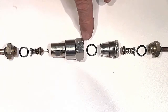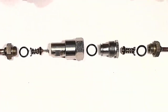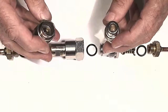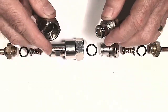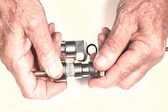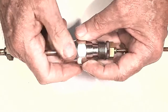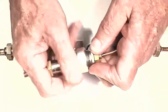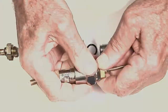In the middle we have the main O-ring, which sits into the groove in the male half. So when the two parts are assembled, we see inside the two ends of the cone valves. When the coupling is put together and the O-ring is covered, then the system is sealed, and making up the thread simply opens up those valves inside, allowing the refrigerant to pass.